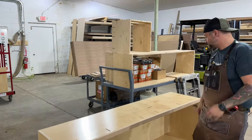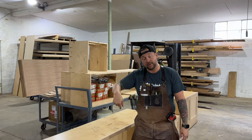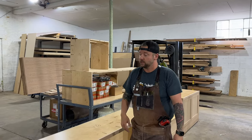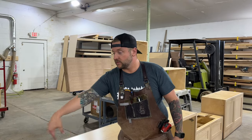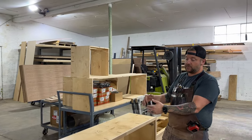We could show you some of that, and the countertops as well — we'll build those up to an inch and a half, and we'll have solid banding on the sides, and we'll have end panels here as well, so you won't see any of these exposed ends. We built the cabinets and we built the face frames.